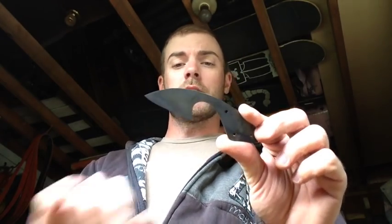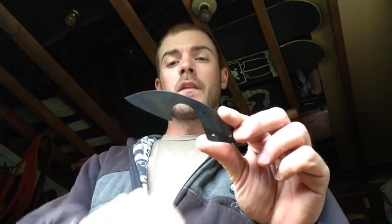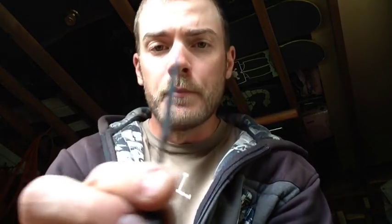I've got a couple little knives here. These ones have been extremely popular since I finished the first two. This one's a little different — it's got a straighter edge instead of the big belly, and it's actually chisel ground, which means one side of the blade's bevel is ground and the other side is flat. I hadn't done one before so I thought, here we go. Also another stainless little neck knife.